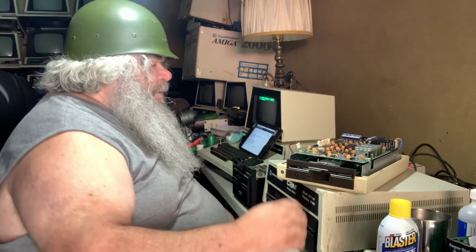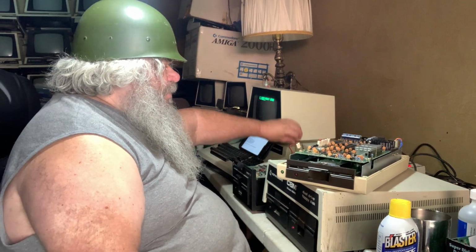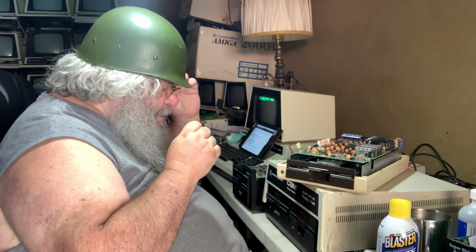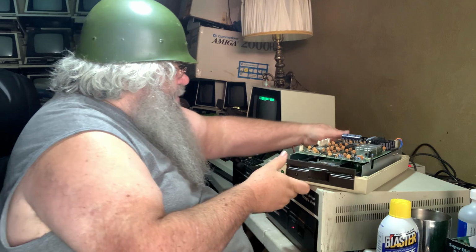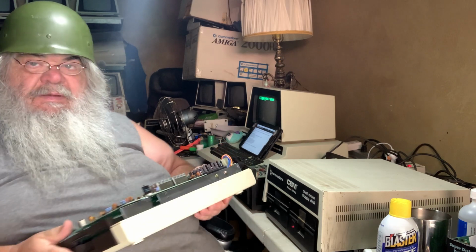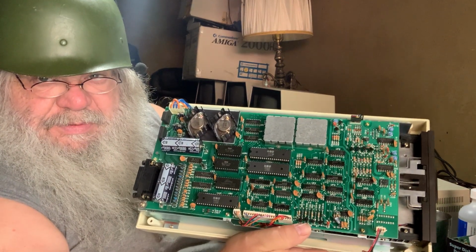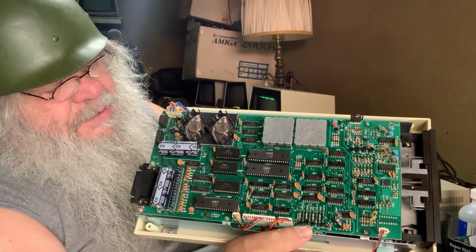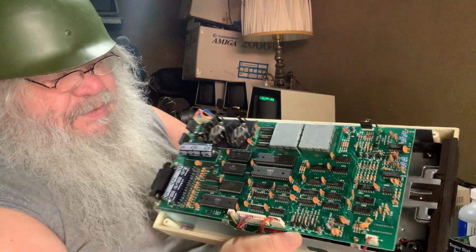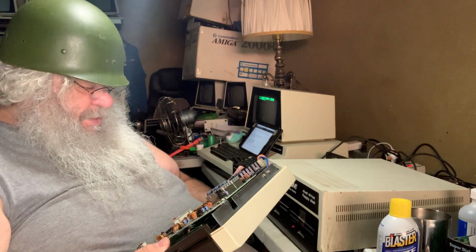All right. So, boy, it remarkably looks like the board of a 1541, which is not at all surprising, because essentially, except for the different interface, that's what it is. Much the same as the high-profile drive, we have a circuit board that goes from the front to the back. It may be not quite as long, but it does look tremendously like the original 1541 longboard. On it, it has a 6502 and two 6522s.